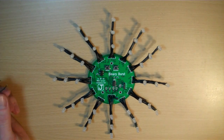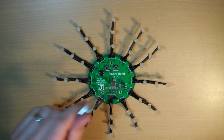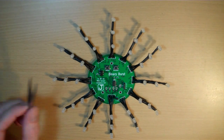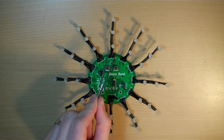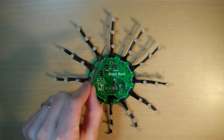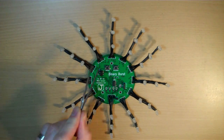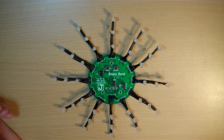Other than that, everything works exactly the way I wanted it to. I'm looking at adding some functionality. I think it would be possible to do some multiplexing to do software pulse-width modulation, which might let me do — for minutes — having all of the blue LEDs in each spiral lit up and it could fade. So even though I only have five minute resolution, it would almost be like a minute hand going around. We'll see if I can do that, and there may be some other options as well — it just depends on what I can do with software.